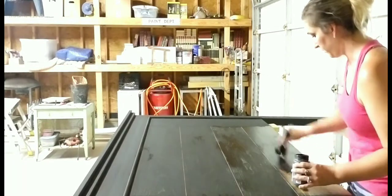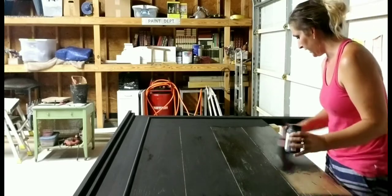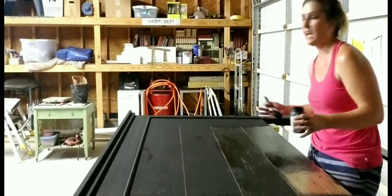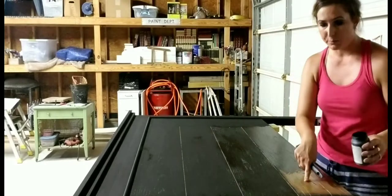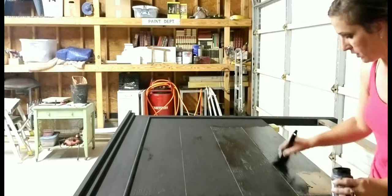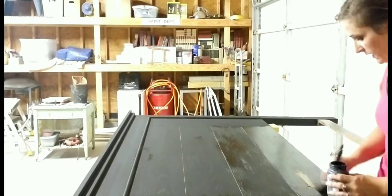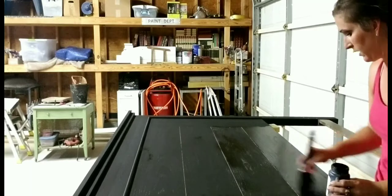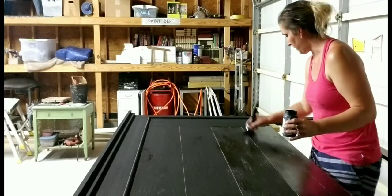I think it's going to look great in her room. I'm so happy I watered down this paint. I think if I would have just did the ink black chalk paint, not watered down, it would just be too black — it wouldn't have any dimension, it would just be flat black. When you water it down a little bit, some of this brown shows through and some of this white shows through. I'm bringing you all in for a closer look. I'm not going heavy on the paint — I just put a little bit on the paintbrush and I smooth it out as much as I can before I dip back into the paint.